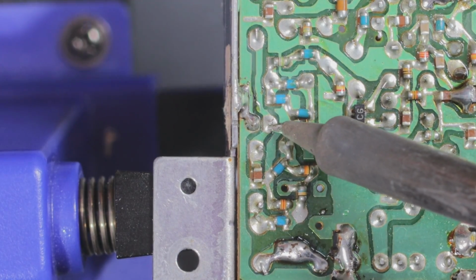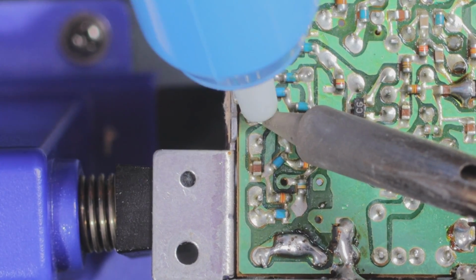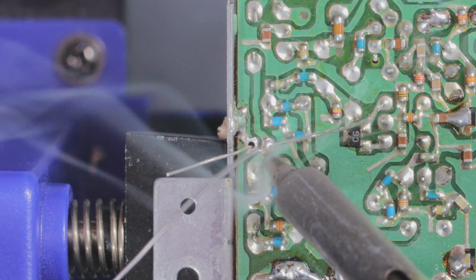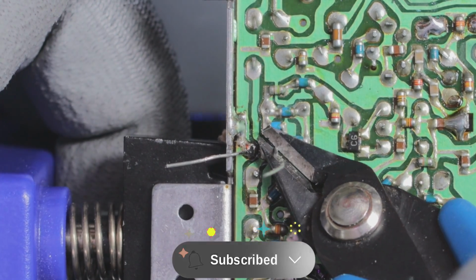And for me, it's right here. So I'm going to desolder these 2 holes. Well, that fell out. And then install the new one. Alright, seated right, spread legs. Solder, solder. Cool. Snippity snip.